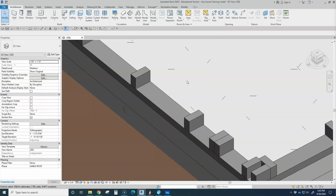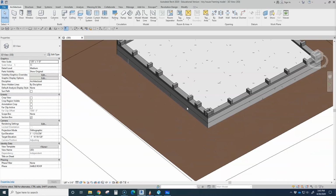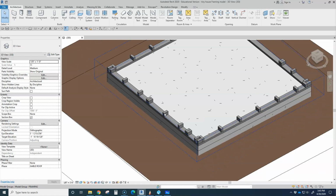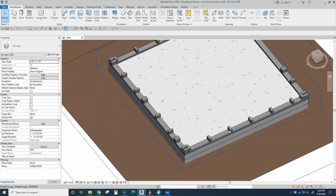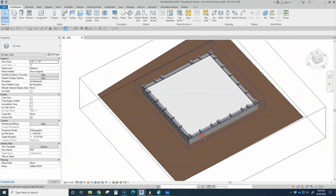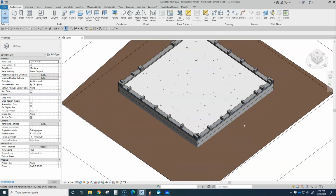Okay, so once you cut it, you are going to lay one down flat that'll represent the sill plate, and then you're gonna cut these studs 8 feet tall, and then you're gonna glue them on top in this kind of pattern, 16 inches on center. So this guy, this guy, this guy, they're all 16 inches apart, with the exception of certain things that happen in this model, which I'll describe to you in depth.